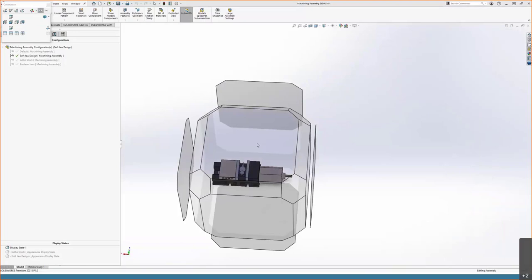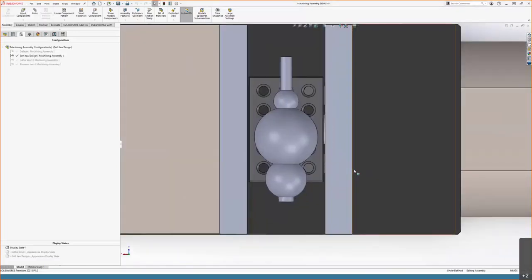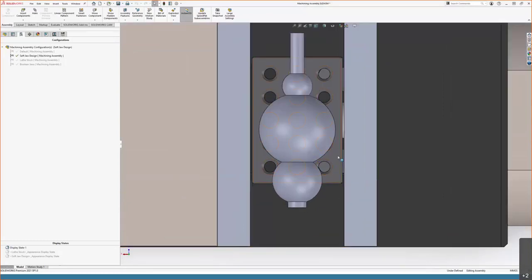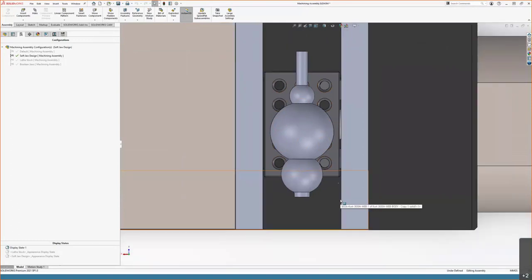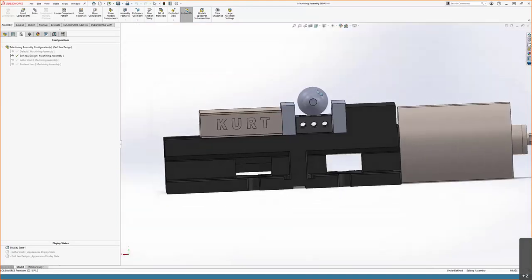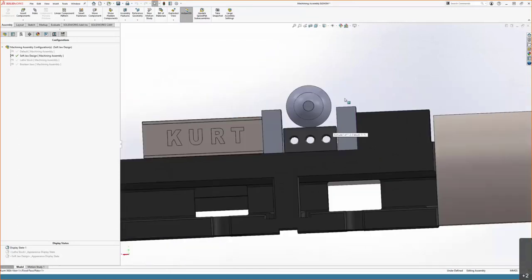While spherical faces are quite slippery and challenging to hold, especially if you're a skilled machinist and get good surface finishes, like I'm sure all of us are, no chatter marks or anything, never. We can see that going to a top view actually does give us a little bit more space to work. I have everything mated in here so that there is distance between my 1-2-3 block and my vise faces.